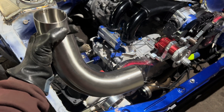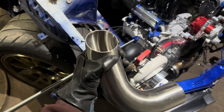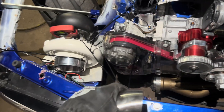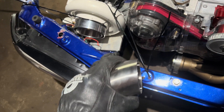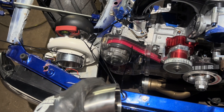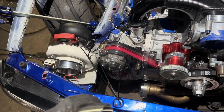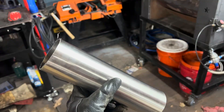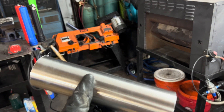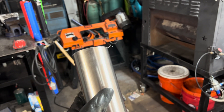This is about what we're going to have coming off the bottom of the turbo — a 45 into a 90, kind of like that, going to shoot that way. I held this under here and it pokes out right about where that frame rail ends. So we're going to take a measurement and cut a piece of pipe a little bit long — maybe a half inch — so we've got some material to work with. I got my piece cut on the bandsaw. You can also use an angle grinder, but I prefer the bandsaw because it gives a nice straight cut.